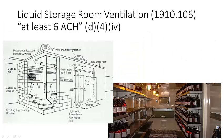Shifting to the inside flammable liquid storage room — there is a minimum ventilation requirement. You need a continuous airflow system so that any released vapors are captured and sent out. There should be makeup air on the opposite side of the room from the exhaust intake. The standard, under section D4, requires at least 6 air changes per hour (ACH). Basically, you need to know the volume of the room, multiply it by 6, and turn that volume over 6 times in one hour.